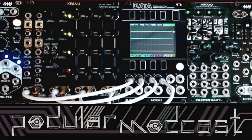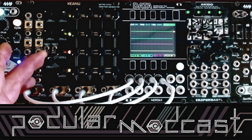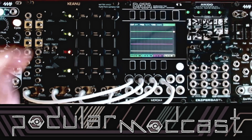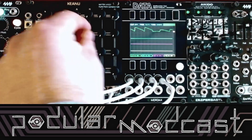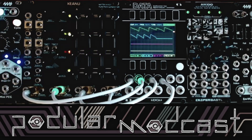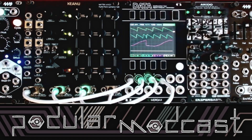Channel three is where things get really interesting. We have three different oscillators that are meandering in voltage and don't really have any link to each other — that's what channels three and four are. We have control over the frequency and we can add some slew. Let me run each channel in and show you each modulation source: here's our first function generator on channel one, our second function generator on channel two, and our first meandering voltage on channel three.